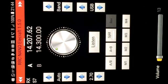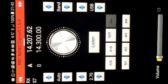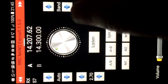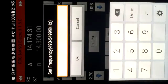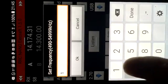Here we have the essential controls, and what we're looking at here is the screen. Unfortunately, because it's in the development stage, there's no landscape picture on it - it's portrait - and I've got the phone in landscape mode here, so you'll just have to tilt your head 90 degrees to read the controls. Essentially we have VFO A and VFO B at the top, and underneath that we have the VFO control. Rotate to change frequency. We can also change frequency by tapping on the frequency indication and then tap in whatever frequency you want and press OK.